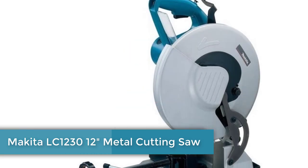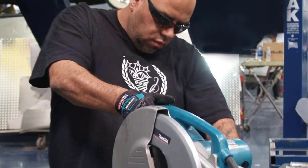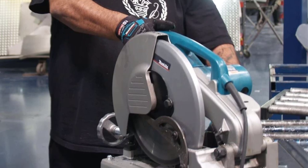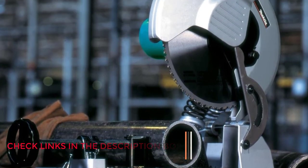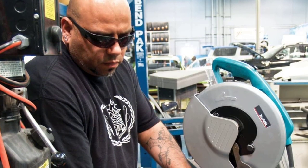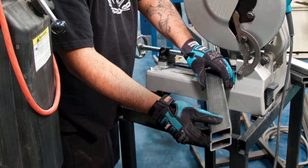Number 2: Makita LC1230 12-inch Metal Cutting Saw. Another popular high-performance choice, this Makita model has a blade slightly smaller than the DEWALT, with a maximum cut of 4.5 inches. However, the 60 carbide-tipped teeth provide fast cutting and a smooth finish through a wide variety of metals. The base is a solid aluminum casting and the blade guard is steel, and it produces very few sparks. The Makita also boasts a quick-release fence for rapid setting of different angles. Although a chip tray is provided, it catches very little. The Makita chop saw makes a useful light-to-medium-duty tool, but for DIY users, it's a significant investment.